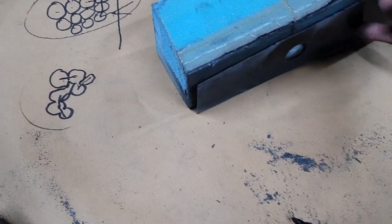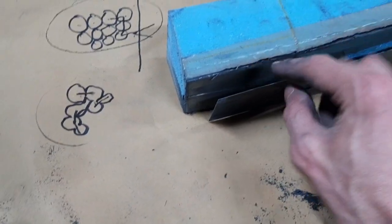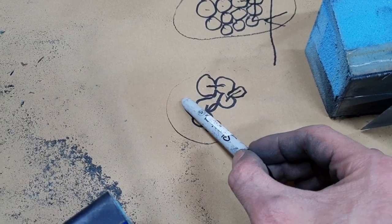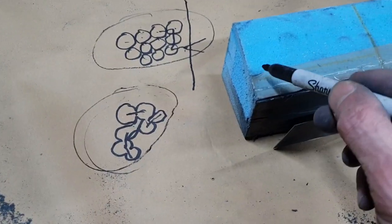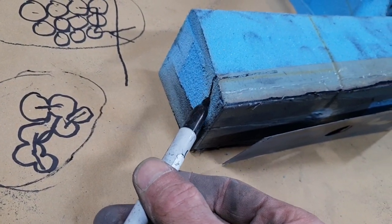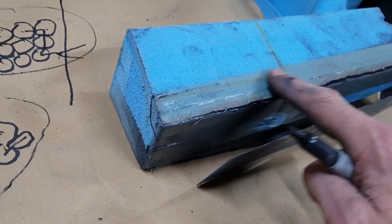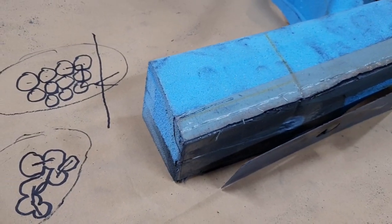on the outside, because that's bonded into the thinner layers, and you're using epoxy here. If the epoxy was to bleed into the foam, which as you see from this it can do, your epoxy could bleed all the way in here if you use too much. It's going to change the properties of the foam all the way into here, because with capillary action the open cell foam will soak it in. So all of this foam would then become solid if you didn't isolate it from the bonding epoxy with tape. So that's why the tape is there. It's there on all the edges that are exposed to the bond line.